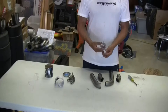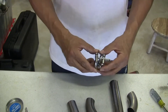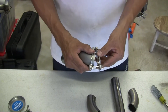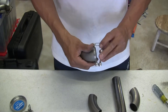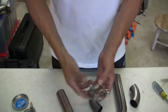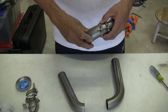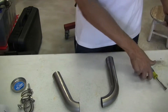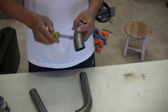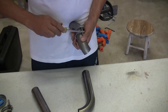One of them creates a rotational motion, which is the fixed end of the adjustable link, and the other one will create the arc. So no matter how much we spin it, we're always able to create an arc to match the receiving section. For practical purposes, we're just going to create a random design and show off the ability of these clamps to quickly create complex assemblies that are held together and can be adjusted until they match the intended end points.